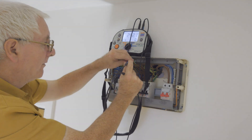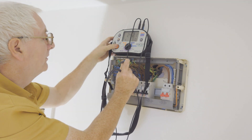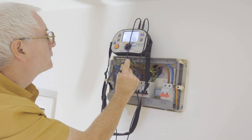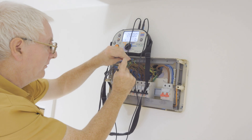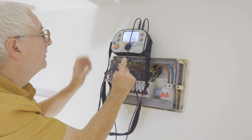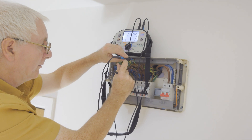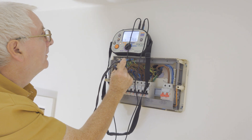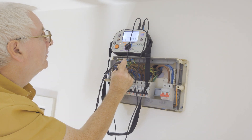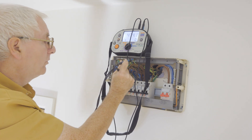242.1 — that's fine for the immersion heater. On the lights: greater than 2000, which is fine. Lights again — 257.9, that's okay, a little bit lower but it's fine. Sockets now: 474.1. So they're all passes — as you can see they're all different values.